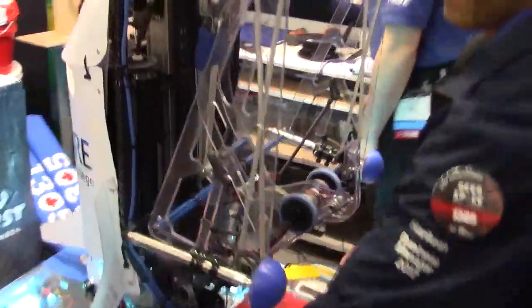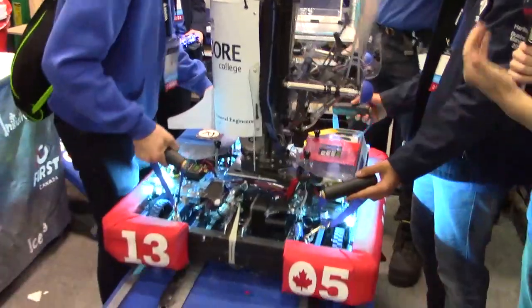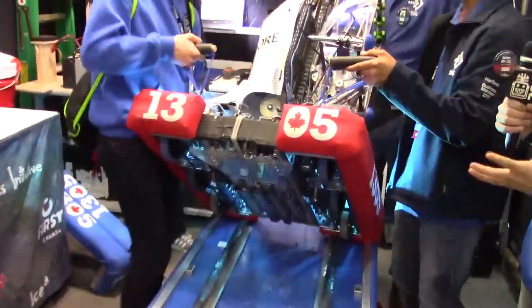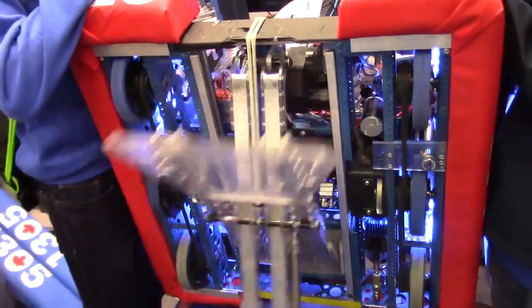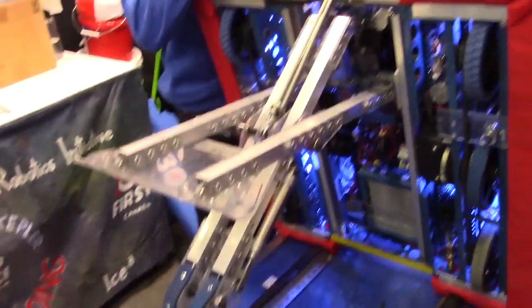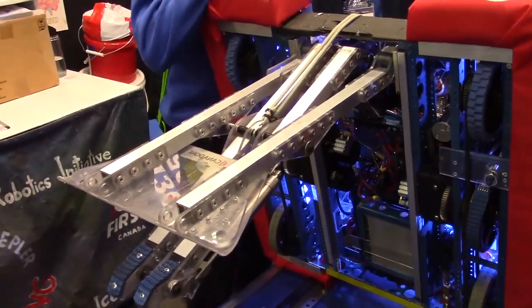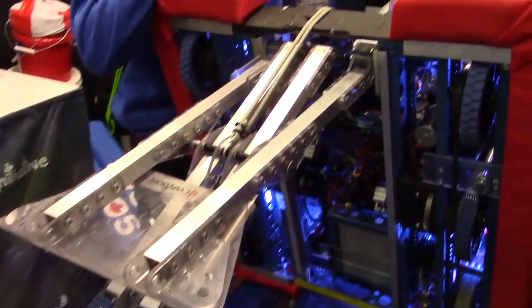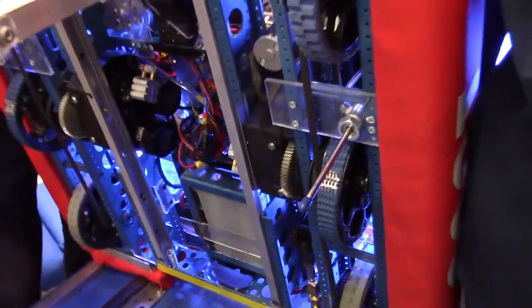By far, my favorite part of our robot is the climb. With the 360 tower, we couldn't have stilts sticking up or anything. So by doing this, we actually had to make our climb system underneath our robot. We created a scissor lift, and what this does is actually climbs really well. Broke a bracket there, but that's okay. This allows us to climb with other robots because we don't use an intake to lift us up.